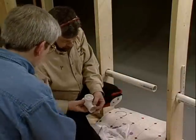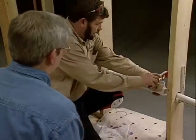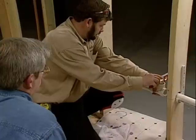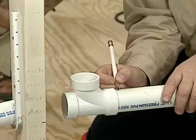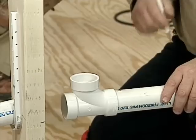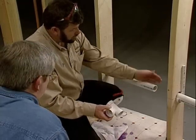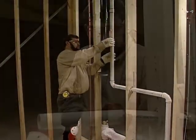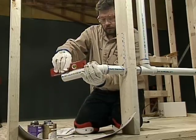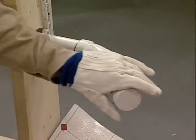There are little marks right on the fitting. When I've got it in position and level, I'm going to take my pencil and line it up with that mark, making it a little longer so if I take a little off when cleaning the pipe I can still see the mark. Then all I've got to do is clean my pipe, clean my fitting, bring it into position, line it up, and I'll be set. I'm going to use my level and bring it in to my quarter bubble. Then I'm going to cap this so we don't have any sewer gas coming into our living space.